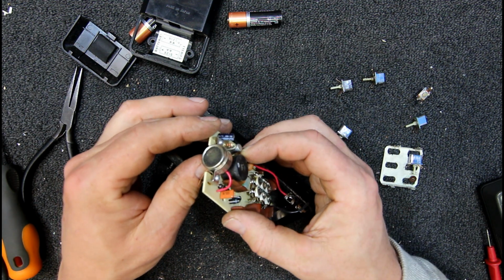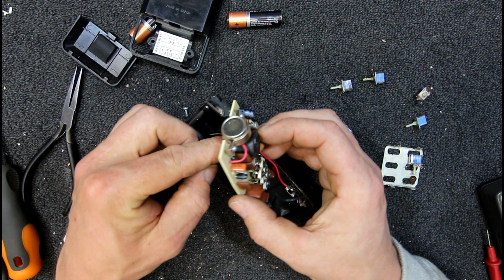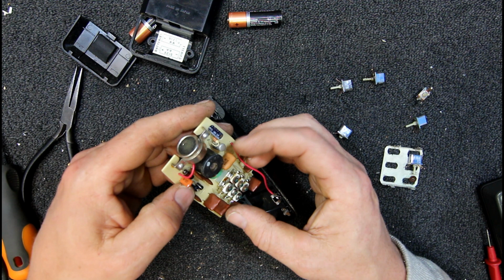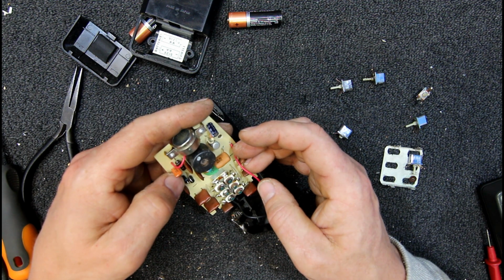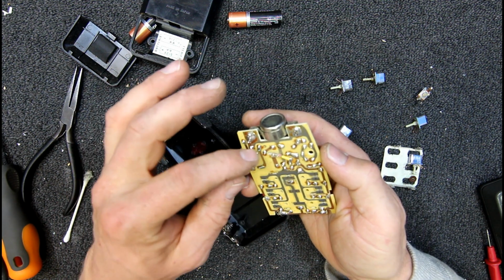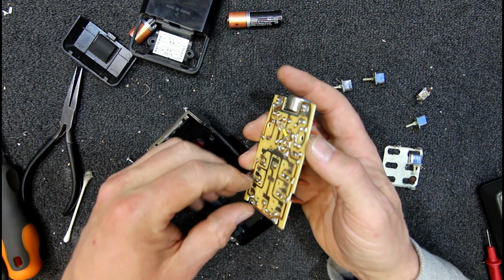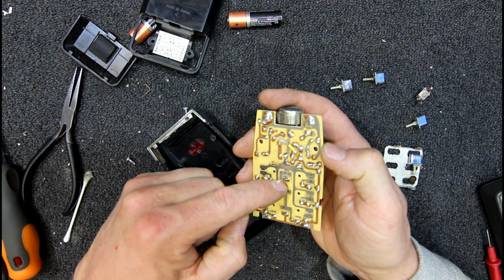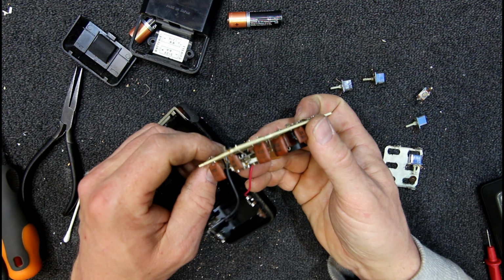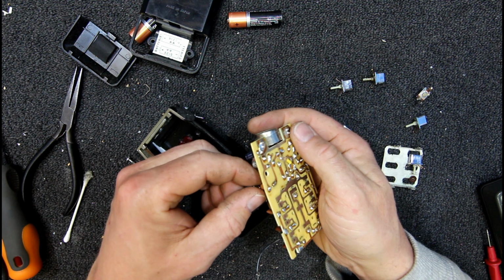Where's it actually connected? It must be those two pins, those two pins. So it's maybe a 4-pin device with a transistor. And yeah, the really interesting thing is this neon. Does that come off one of the, that's a common line or something? That's the negative. The battery goes to these, so the negative of the battery is what's connected to each thing when we press the switch. Well, it was until it just fell off. That's what you get for fiddling with these things too long.